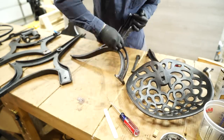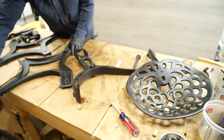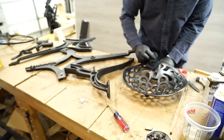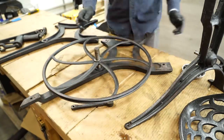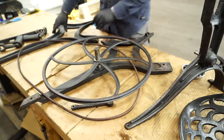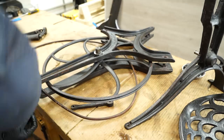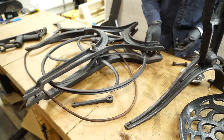A lot of people think they should oil tools and metal parts like this to prevent rust, but by leaving a wet oil on the metal, it's just going to hold on to any dirt, debris, or dust, and in this case, sawdust that touches that oil, and it'll look terrible and eventually cause problems. That's why I prefer protective finishes like BLO and paste wax that are going to dry hard and still provide that nice layer of protection.